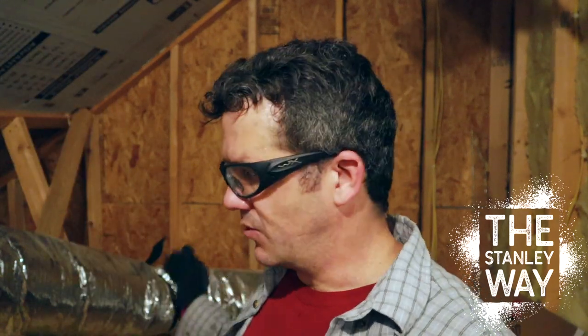I messed up — I thought I had a can of spray foam here, so you're not going to see me do that. I've got to go back to Home Depot after I just went there this morning and get another can of spray foam. All I'm going to do is spray around the edges to kind of seal it, and eventually all the walls of the attic are going to have foam board insulation on them as well, so that the walls and the roof line below the rafters of the attic will all be insulated.